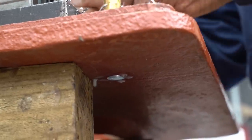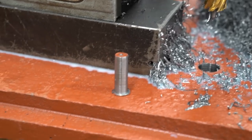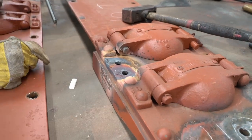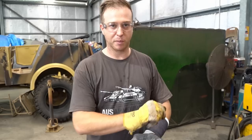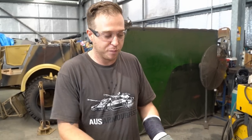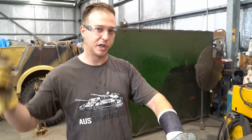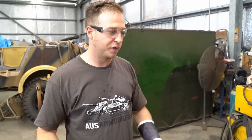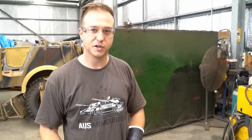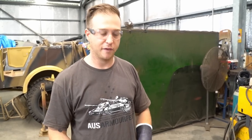Meanwhile, Jesse has been working hard punching out rivets. Last week I was working on the rear engine deck hatches - we had trouble getting them apart, trying to get the hot rivets out. I've had to cut the majority of them off and blow them off with heat. It's extremely hard. The only way I've been able to get a few out is by heating them up bright red and then holding a punch onto them and hitting them as hard as I can. I've tried drilling them, tried heating and quenching, and nothing's working - extreme heat and hitting them cherry red is the only thing that works.